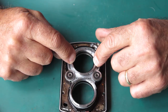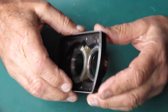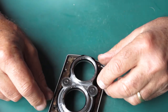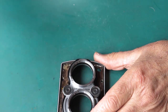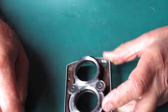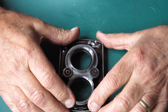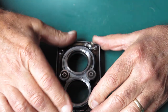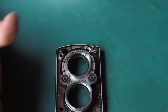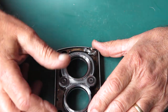Now we get down to the filter mounts. These filter mounts are the male half of the nut that's screwed on at the back. The upper and lower filter mounts are basically the same — they've each got a little stop pin in here. The job of that stop pin is: when you put a filter in and rotate it to bayonet it into place, you can't swing it back beyond that point. It can only go in one way — bayonet on clockwise, undo anti-clockwise to remove. Easy.